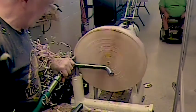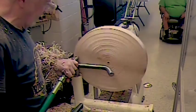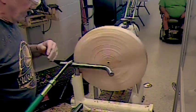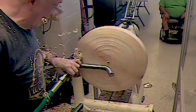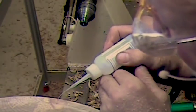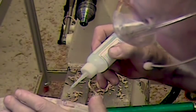So you see, now I've changed the position. I'm not like this with the tool anymore. I'm like this, and I'm actually rubbing the bevel and making a nice cut. It's perfectly possible to make a finished cut with this thing. I'm going to go up like that first with the shape of the brim, and we might gain a little bit from that. We have a little tiny knot right at this end, which is kind of fun because they can cause a little bending that could be like a little twitch in the brim.